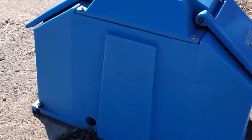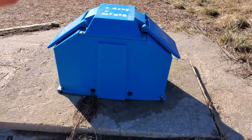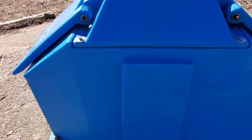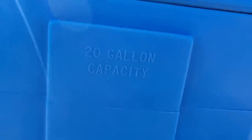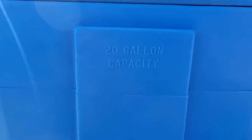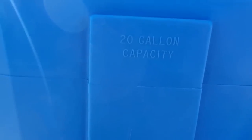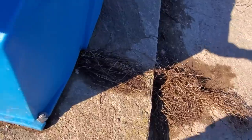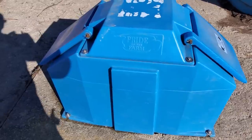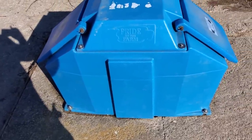That is a 20-gallon frost-free tank. It's got a four-foot culvert right in the middle going down into the ground, and the heat of the ground keeps it from freezing — and it works. The problem is right here: 20 gallons. That's what it holds, and we're watering 295 head. In the winter or summer it really makes a difference — in the summertime you're never going to keep up with your cattle. They're going to be standing in line waiting for a drink. It only goes from two-inch down to a three-quarter-inch feeder line.